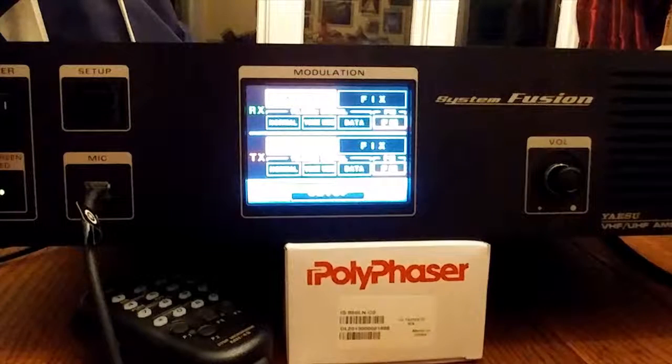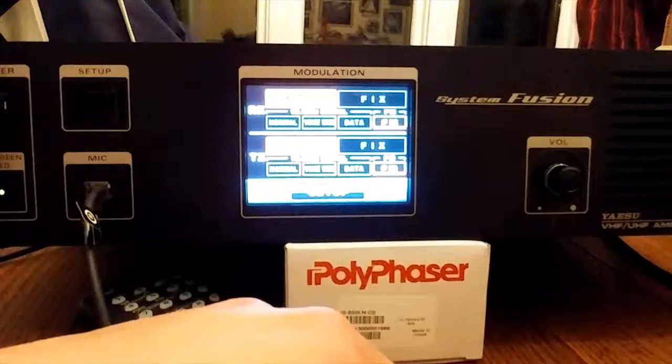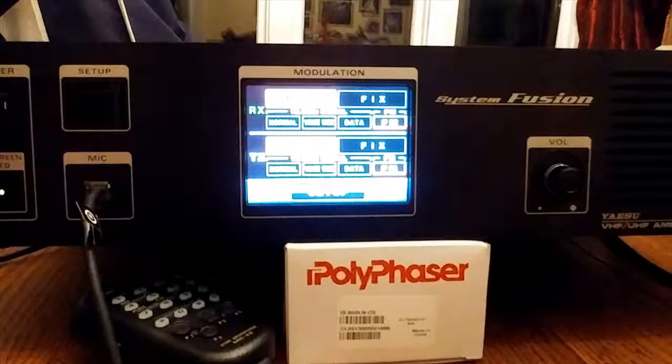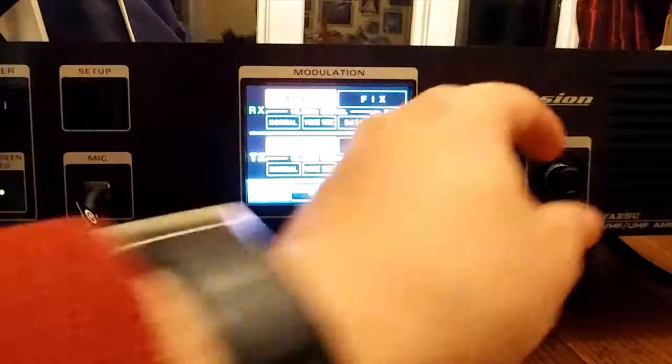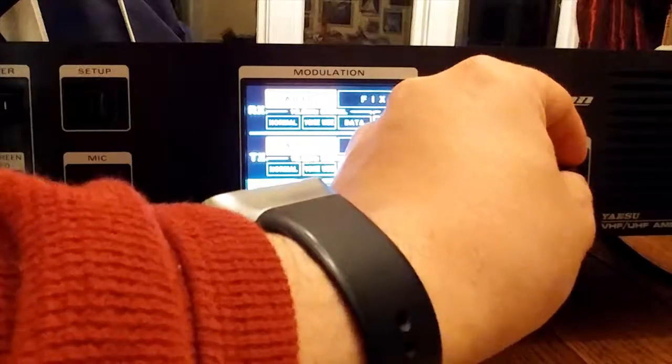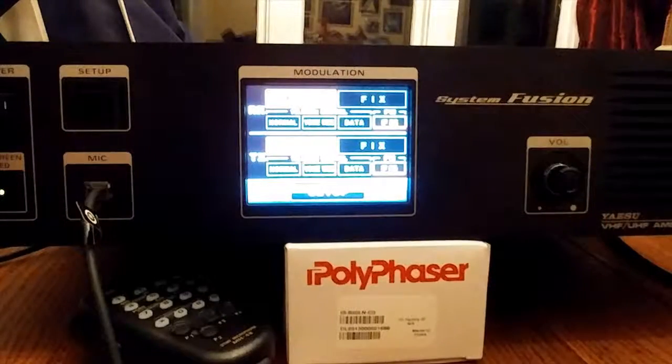the radio transmits, and then when I unkey, you'll hear that initial hard squelch crash. That's the repeater speaker. If I turn that all the way off, you'll hear my handheld 470 speaker squelch as well. So I'm going to try to match the volume. So do you hear the delay in that? It's like 40 milliseconds maybe.